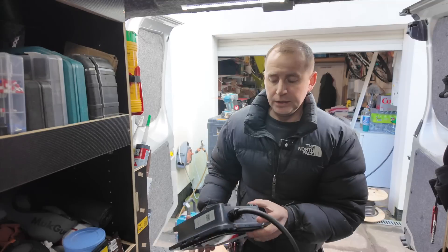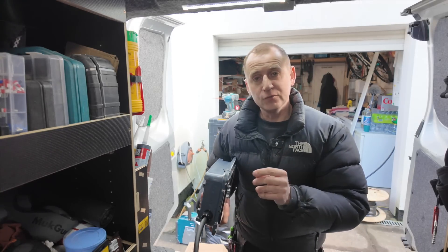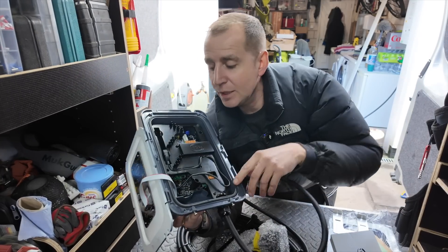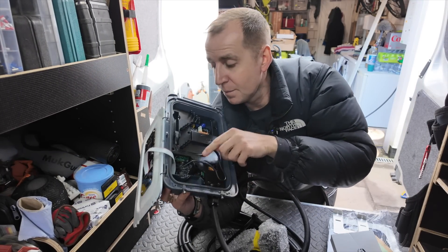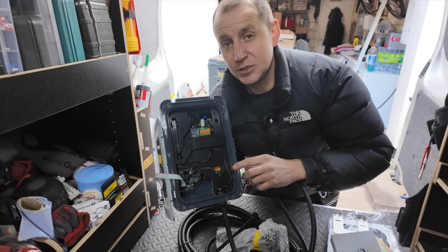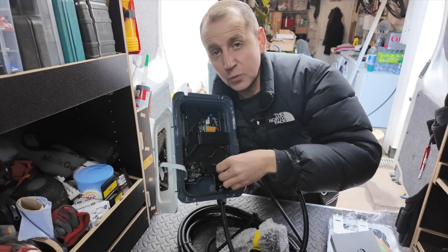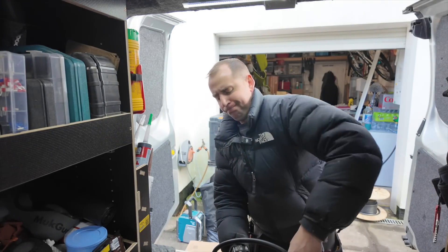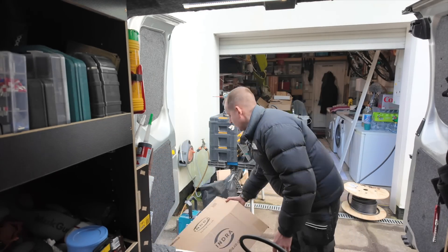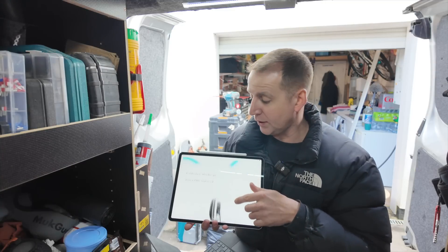This charger has three cable entries - two at the bottom and one in the back - and I want to try and go back entry today, but it all depends on if I can get my 25mm stuffer in there with still room for the cables. Inside, there are little clips to route your cables into the connectors, forcing a good installation which is great. Up here we have the CT connections - you're going to need a punch tool for that - and this cable here is for the wireless dongle. On the box there's a QR code to scan for an in-depth how-to install guide, so you can't go wrong hopefully.